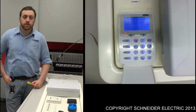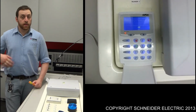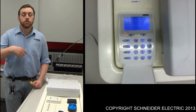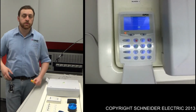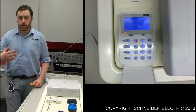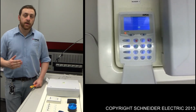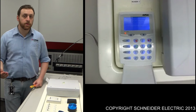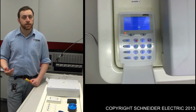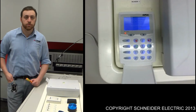The first occasion could be, let's just say for example, the area where you're living or where this is installed has experienced a power blackout. Now what happens is the system basically uses its own internal power to maintain security for that property or premises. It's going to discharge a portion or all of the battery, depending on how long the power is out for, and then it's going to require some time to charge up. This message that you're seeing on the screen can pop up in those circumstances, and all it requires is probably around 2 weeks worth of charging before that symbol disappears.